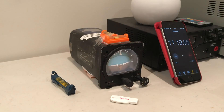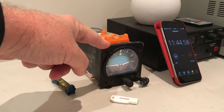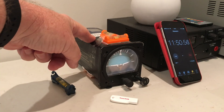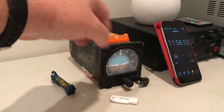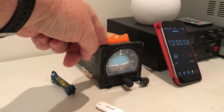That is why when this instrument flies around the earth, which changes the direction of down by one degree for every 111 kilometres - and that takes eight minutes travelling at 450 knots - the instrument is constantly correcting for the new direction of down. That is why as the pilots fly across the curve of the earth, the instrument is always showing a level indication. It's a complete fallacy to believe that the gyroscope inside this instrument is remaining rigid in space - that's completely wrong. The pendulous vanes, which I have shown in previous videos, are constantly correcting it with respect to the direction of down, and that is why as it flies around the globe, it is always showing a correct level indication.